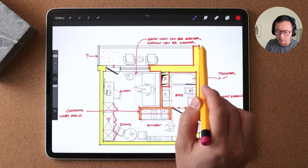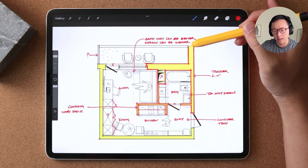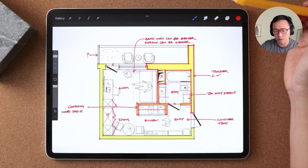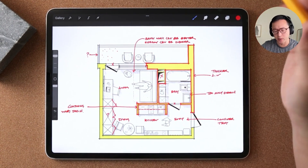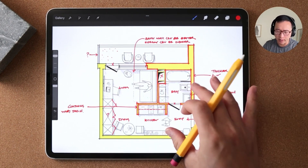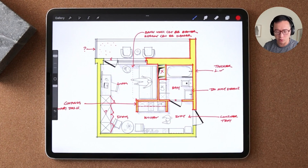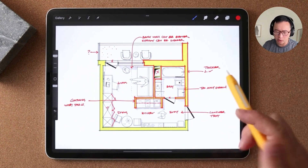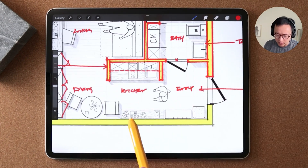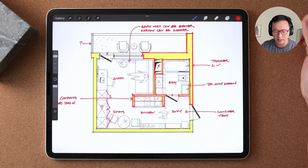This railing here — I'm not sure why it's colored in on one side and not the other, so a little more information would be nice. If it's a glass railing, it may look thinner; if it has posts, you may consider showing the posts every four feet or so — whether it reads as cable rails with posts or a wood guardrail. Right now there's not enough information for me to understand what that is even in plan. Your information should be fairly consistent from the inside to the outside — if you're showing all of this fantastic detail on the table, bring that same level of consistency to the outside as well.